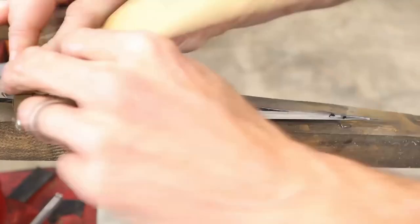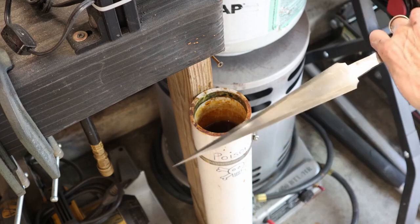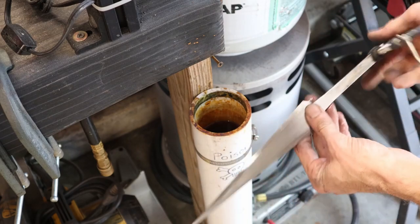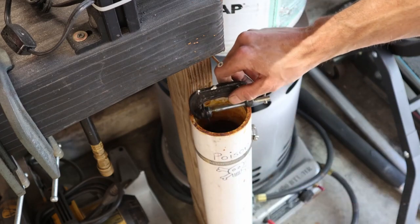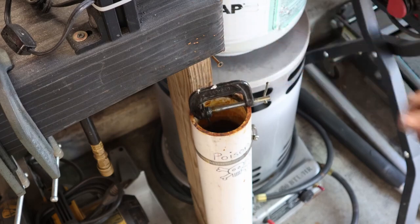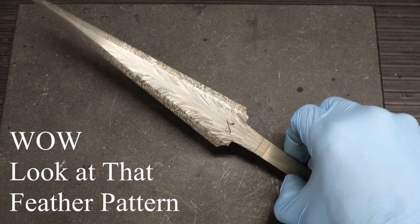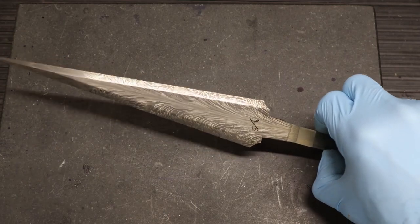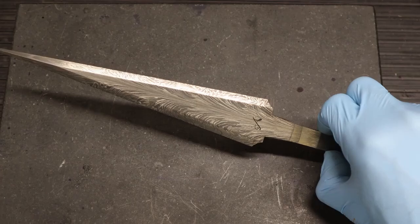Now it's time to make that grain pop. We're gonna go ahead and hand sand this thing out after heat treatment. Everything's completely hand sanded up to 500 grit. We're gonna throw it in my ferric chloride and distilled water mixture. We're gonna do this several times — I want this grain to be nice and deep on the edge because I'm gonna do a coffee etch on this. Here it is right out of the etchant; I haven't done the coffee etch yet so it's kind of a neutral drab color. I'm gonna polish up the top 15 and 20 layers and then throw it in a nice coffee etch so it really makes that pop.